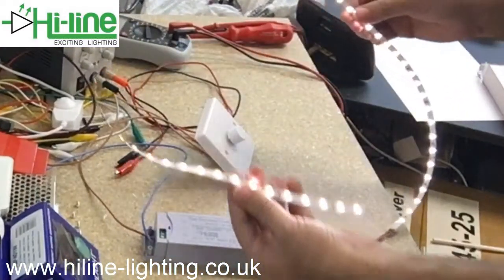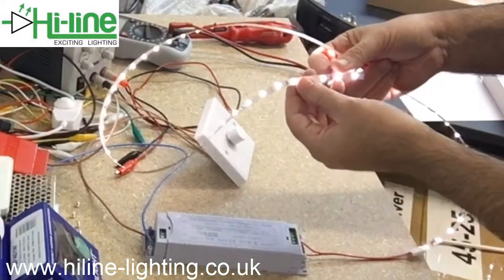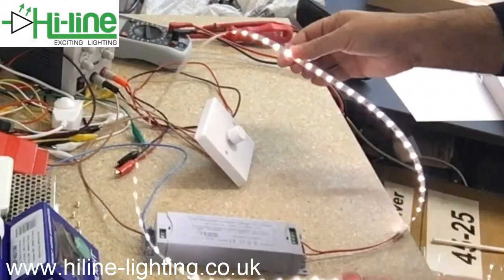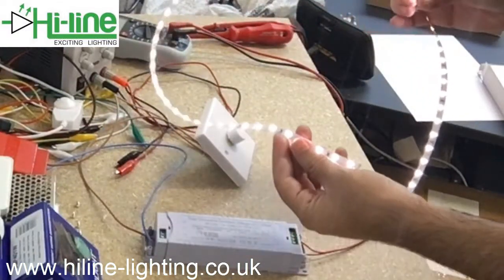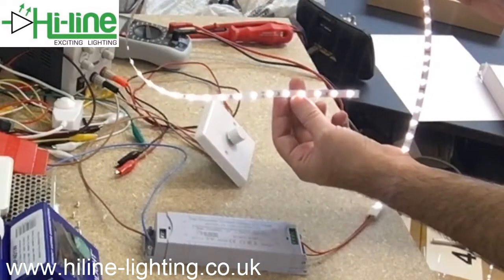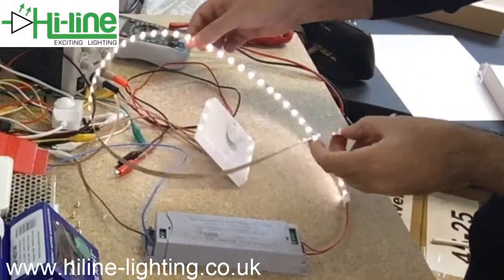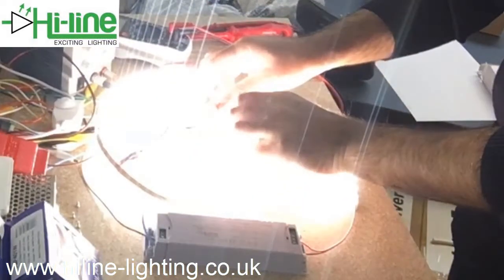The minimum dimming is slightly higher brightness than with at least 30 watts load. So the minimum dimming level in the case that the load is not at least 50% of the driver's rating is a bit higher than it should be, but it still operates without any problems.